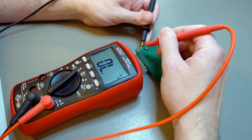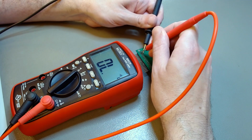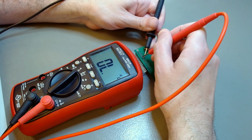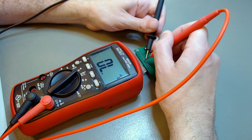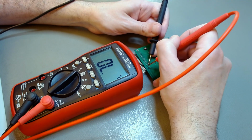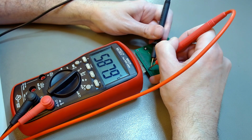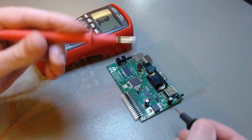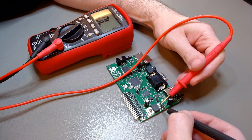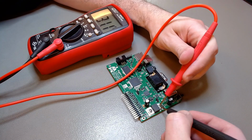Now, the very final step before you turn it on is to check for short circuits between adjacent pads, especially of the GPIO connector, which has a lot of soldering involved, the VGA connector, the ZDI. I always do this offline. I check for short circuits between adjacent pads. You should have the schematics with you because sometimes there is a short, but it belongs there. And then you check for short circuits across the pins of the regulator. Ground is on the right. In the middle is 3.3 volts.